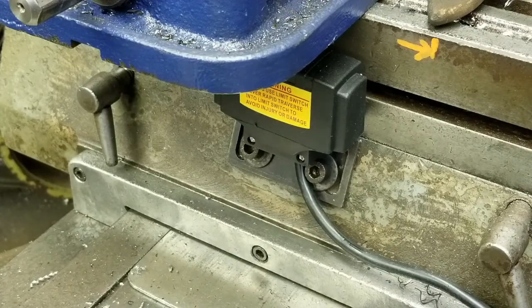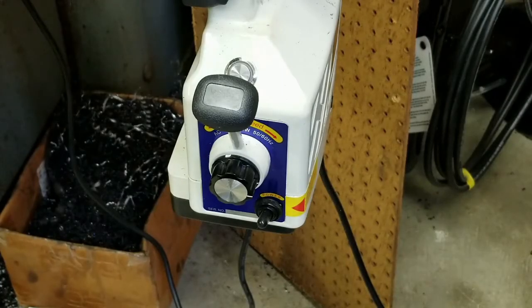I'm usually right at this mill — it's where most of my work takes place. So the limit switch bracket is another issue, but not a showstopper. Some guys might not want to deal with it; I'm just trying to be transparent about what I found. And finally I'll show you the last problem, which almost made me send it back. Nowhere in the description or the brochure-style instructions does it say anything about the electrical, other than that it's a 110-volt unit. It doesn't specify amps. Out in my garage the closest outlet to this unit is a GFCI plug — it's a 15-amp plug.